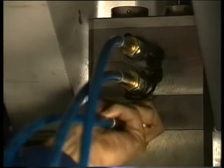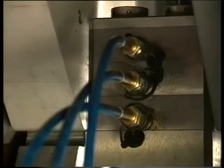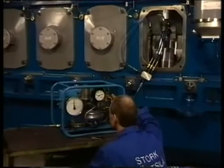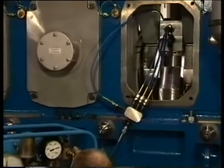After the jacks have been connected to the pump, re-tighten the nuts of the jacks with the hook spanner to bring the jacks in bottom-most position. Connect the second set of jacks using an oil distributing block and subsequently fully pressurize the jacks simultaneously.